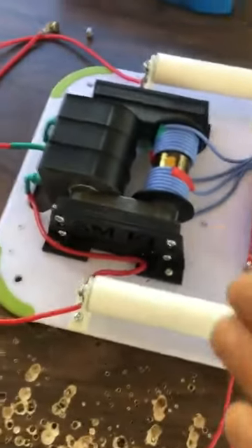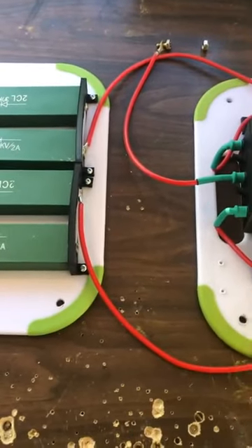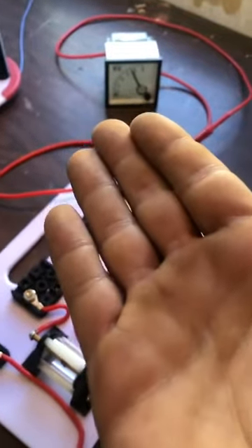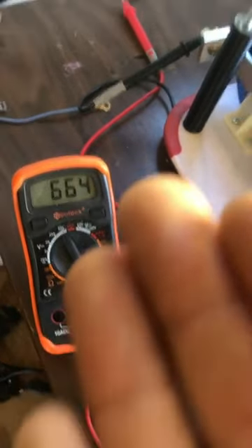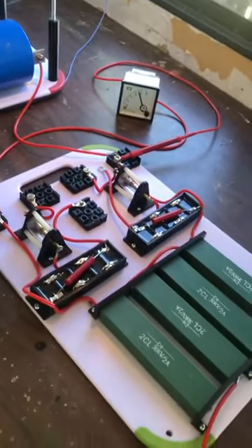This is operating in resonance. We don't really need the second resonant transformer, but I'm going to put it in. The voltages will be different, but here we're at 21 watts, running at just over 7,000 volts at around 44 kilohertz into the cap, reducing it to 600 volts to charge a very large capacitor. This thing is dialed right down — I can turn it up crazy amounts, it's turned way back so I don't overfill those caps.